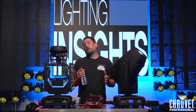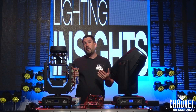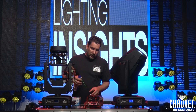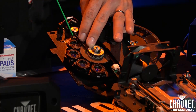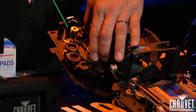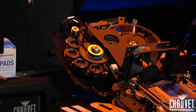If you're in a really tight situation on a show site and your gobos are really dirty, canned air is a good solution for that situation, especially if you've got a lot of gunk on your gobos and you don't have time to take your entire bulkhead out. Just make sure not to allow your fans to free spool, and give a little shot of compressed air onto your gobos — that's going to blow out most of the dust that was obstructing them.